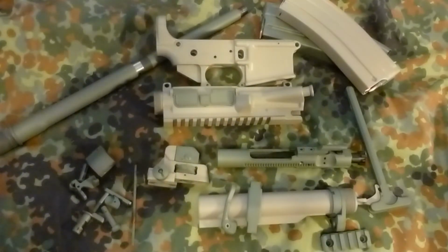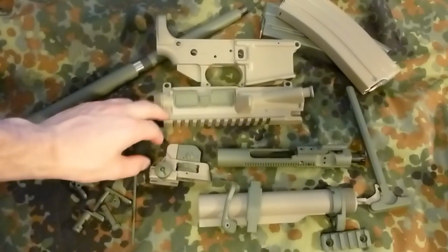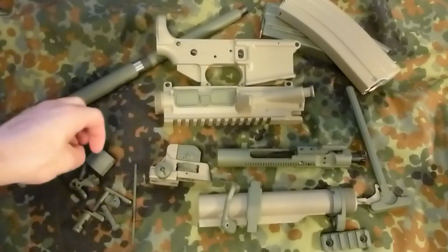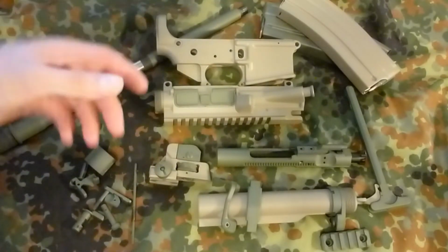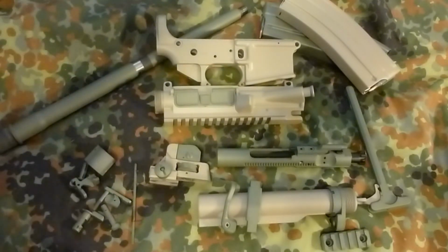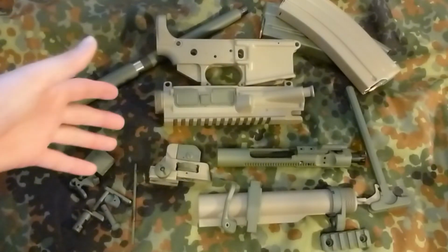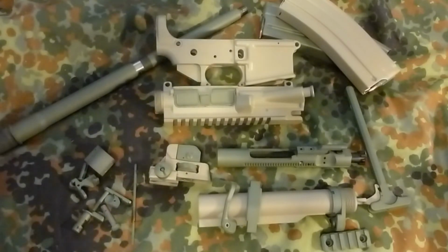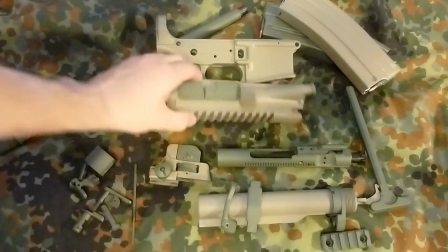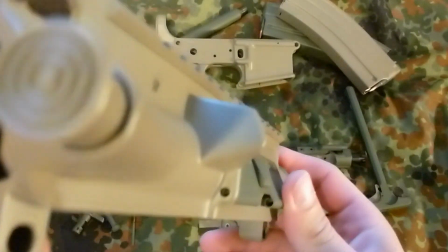One of the things that is both good and bad about the gun coat is that once you cure it in the oven, solvents won't take it off. So I can't dip the stuff in acetone or something like that and remove the finish. If I want to remove the finish and try again, I've got to sandblast everything and then redo the entire process. Which for little spots like that, or like on this guy, see if we can get that in good light.